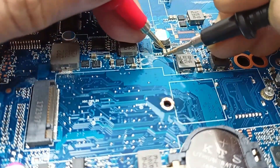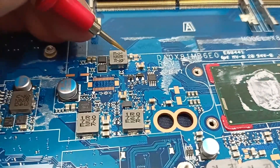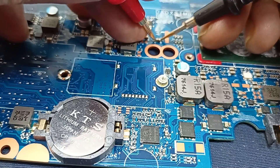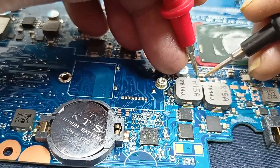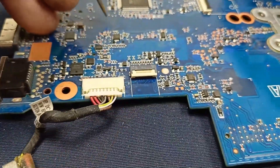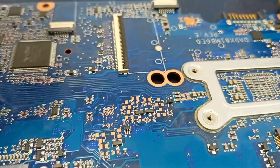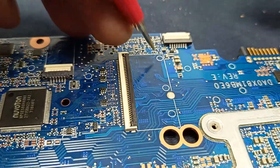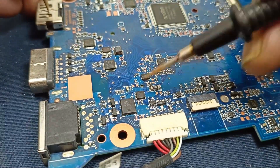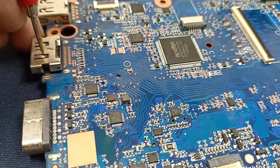Here it is showing 6.6 ohms — that is okay. This is the processor area and here it is not shorted; showing 6.6 ohms, that is okay. This one also has the same resistance — no problem. There is also no liquid damage and no burning issue. This is the main output voltage of the power supply — that is okay. But what I can do: I can clean the circuit and after that give some heat, then check what happened.